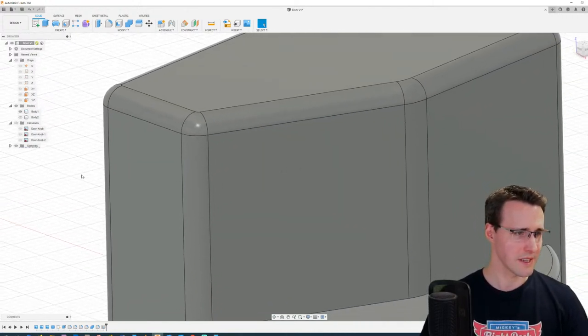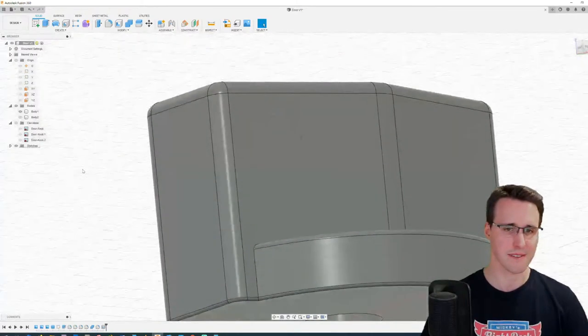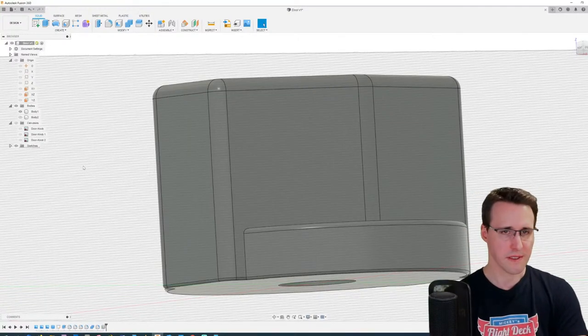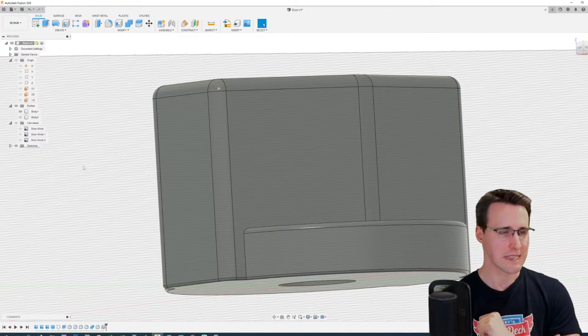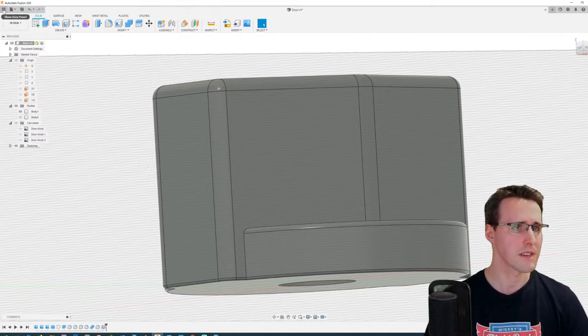And Indian Aviator, what should be the clearance of the hole to the shaft? Right, what I said, I think you have to measure your shaft first. If your measurement shows that the shaft already doesn't have the exact 6 millimeters, then I think I have done other knobs with no clearance.